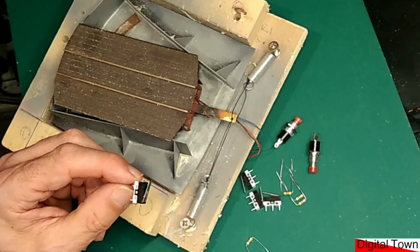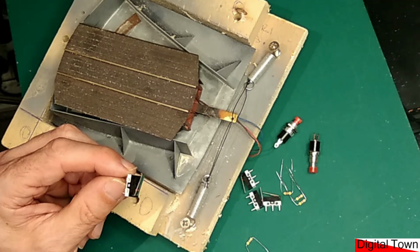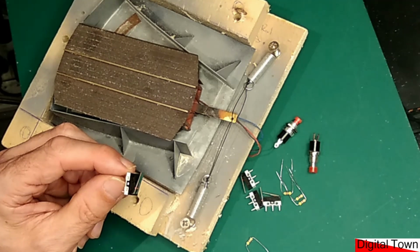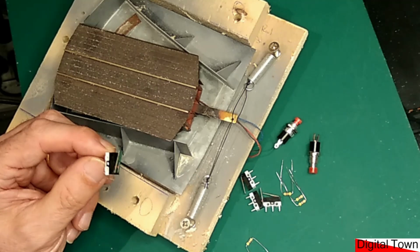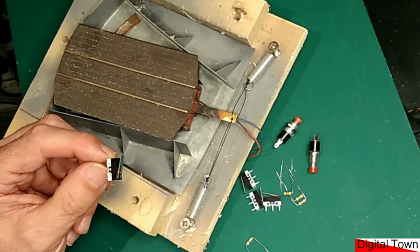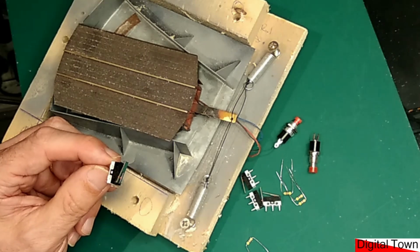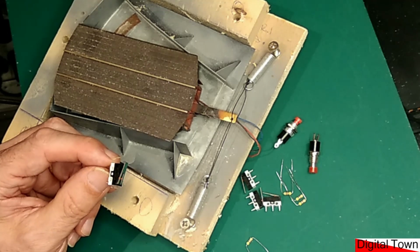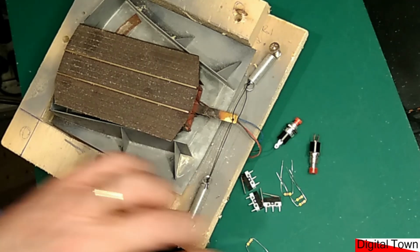But there are other occasions where actually you may want to know that you may have, for security reasons, power has to be on all the time, and if it goes low then you know you've got a problem. So again, when you are thinking from a fail-safe point of view, do you need pull-up or pull-down resistors? That will really depend on the situation that you want the unit that you are working on to fail safe in. So just an odd one to think about.